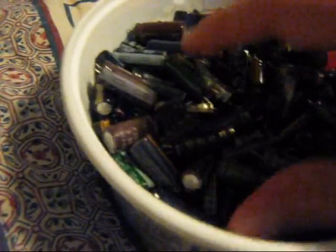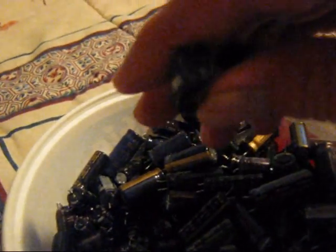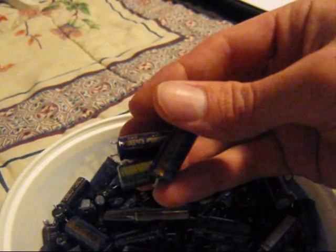As I mentioned earlier, I take good capacitors off of non-working boards. In this container I have lots of various grades of capacitors — this one comes off of an e-machines board, this one comes off of like an HP board from around 2001. All three different kinds, all cylinder capacitors. The reason I keep these is so that if I ever come across a board that has bad capacitors but seems to work otherwise, you can re-solder new capacitors onto the board. So I save these good capacitors and reuse them on boards that need the capacitors replaced.